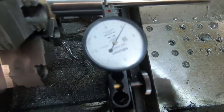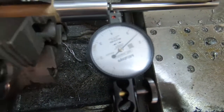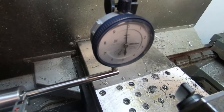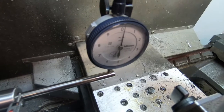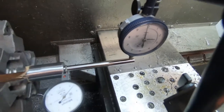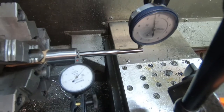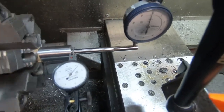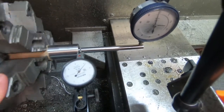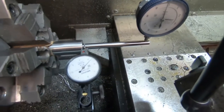We're back, and we've got this one down to just a few tenths of a thousandth of movement at the muzzle, and this one is about one ten-thousandth - maybe even a little less. This is close enough to where we'll get the next indicator set up with the long stem to reach inside the bore and measure directly. That way we're getting a true readout of the actual bore itself. We'll get that running perfectly straight, and then we'll put the half-28 threads on using the program.